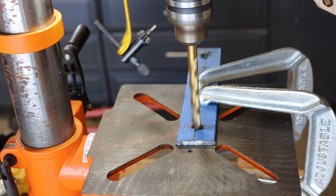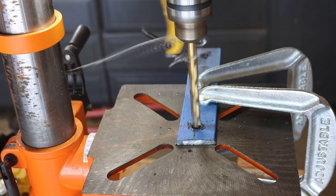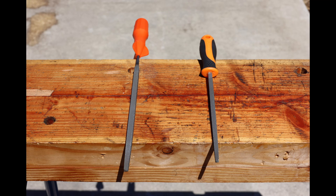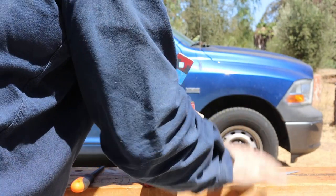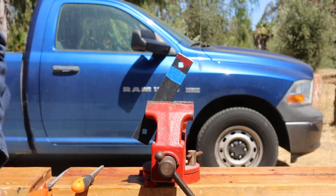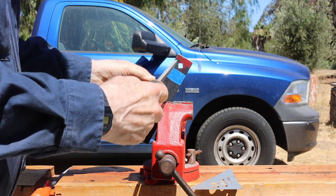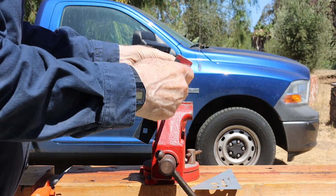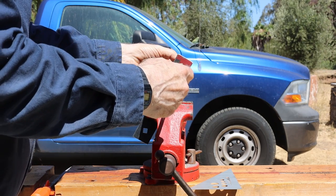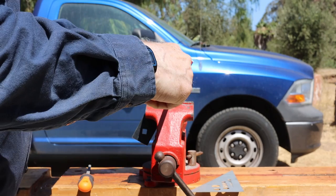A titanium drill bit in action. I used a 5/16-inch square file and a 3/8-inch square file — I've used these a dozen times before to put square carriage bolt holes in metal. You really only need the 3/8-inch file. Set the flat bar to 30 degrees from vertical and tighten really well. File straight up and down — I usually do 25 strokes on the bottom, 25 on the top, 25 on the right, and 25 on the left, and repeat until the file goes through. I used the 5/16-inch file before the 3/8-inch, but it wasn't really necessary. About 10 minutes a hole.